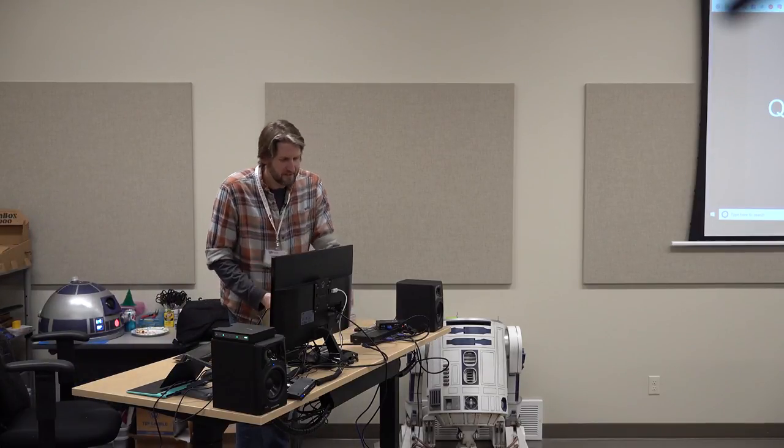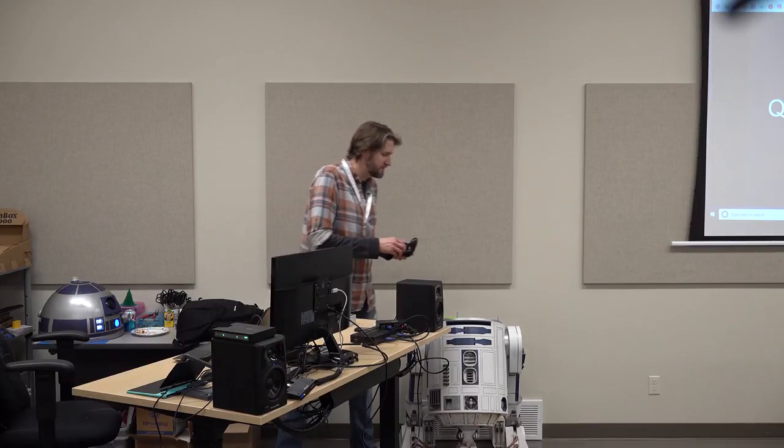This part's a little nerve-wracking. To control it, it's an Xbox 360 controller. Somebody wrote code for a PlayStation 2 controller, and then those were hard to find. So they updated the code, and it's called Padawan 360, and the code's on GitHub. So you buy the controller, and then you have to buy an Xbox wireless receiver and plug it into a host shield on the Arduino.